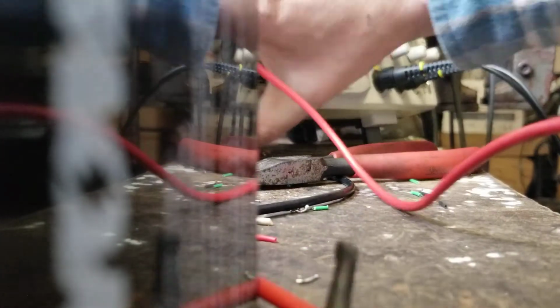So standby's off. As you see, we get some bleed through. Even with the bias, if I crank the bias all the way positive, so I'm down to like -8 volts, which means I'm running about 82 milliamps from what I gather through the output tubes. And you see it still bleeds through. Let's see if I can get that a little better.